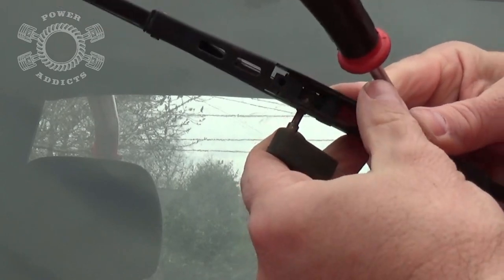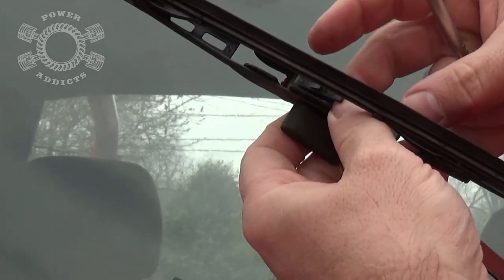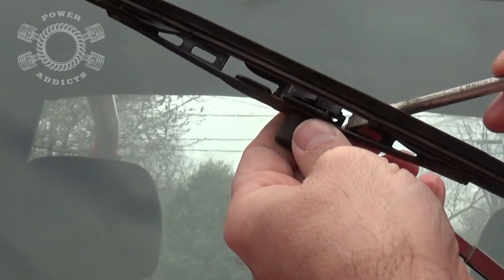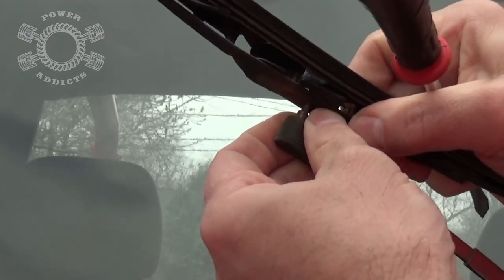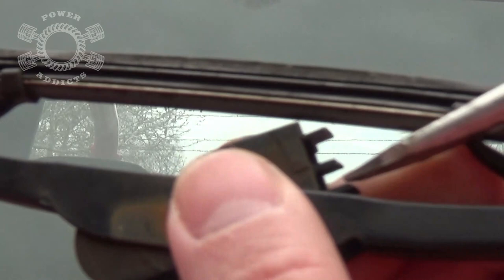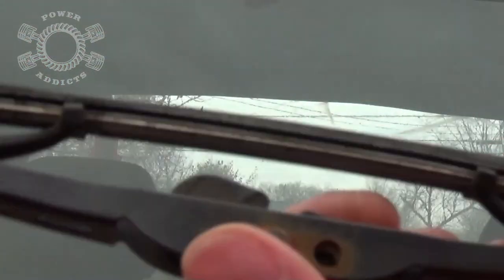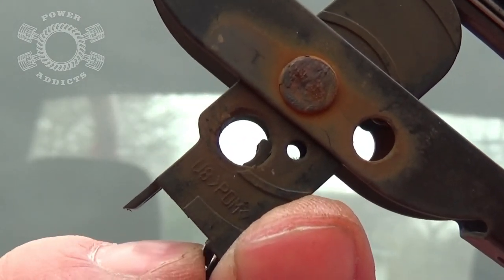Let's demonstrate it one more time. We'll snap it back on, just like this, we'll flip it, and if you can pull down enough to come off, you're great. You've got two choices: you can either push it down from the top or hook it from the bottom. This little tab, when you push it up, it disengages from the groove of this post right here. It allows it to unlock and it'll slide right up on out of there. Push it down, it disengages it.